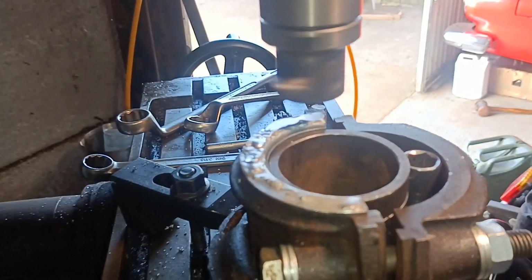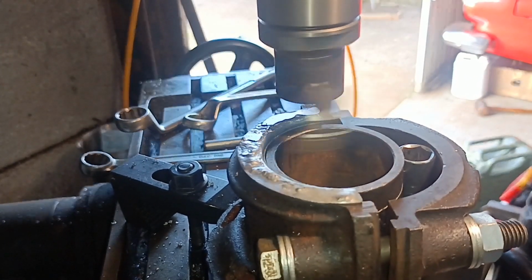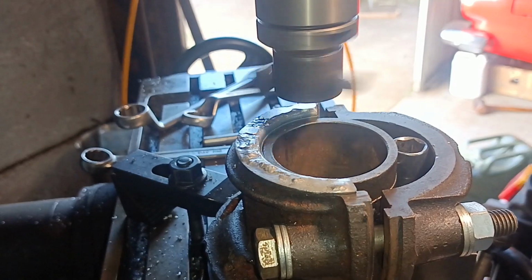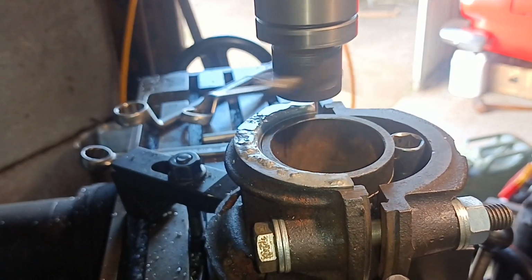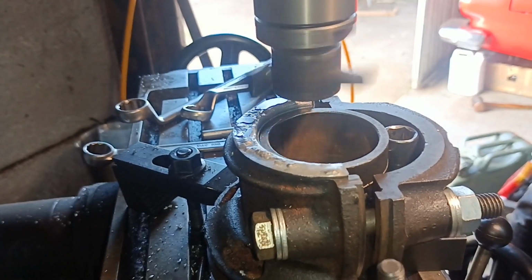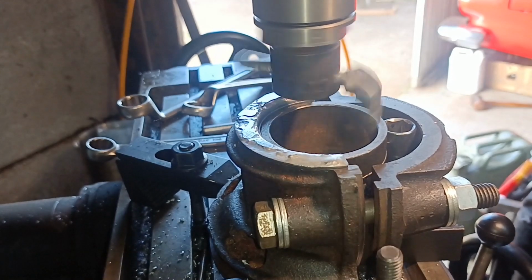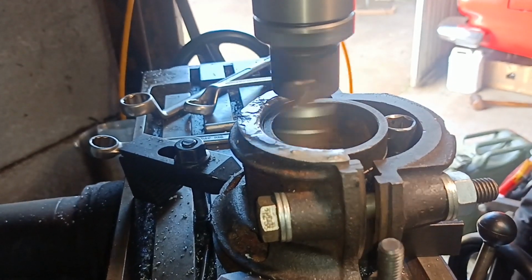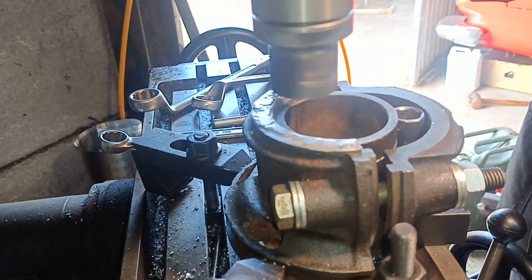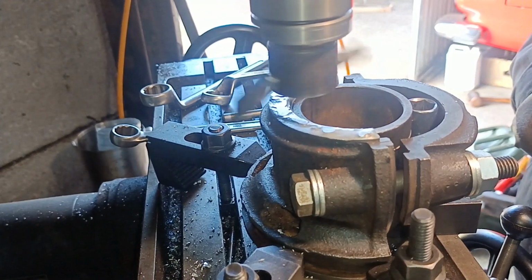I might have to go and build it up a bit more. You know, I'm learning. I'm on a learning curve. My cutter cuts on this back edge, so that tells me that the head on the machine is slightly out of tram.